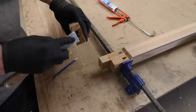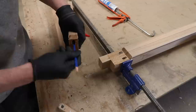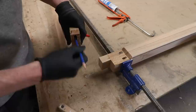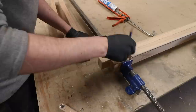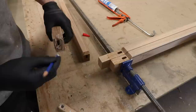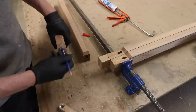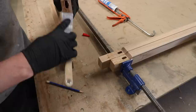There is a point at which it's drying where it's still just sticky. It's pretty much set, so it holds a bead, but it's just got a bit of stickiness to it. If you start paring the excess off at that point, it makes a bit of a mess of your chisels, but it seems to be dead easy to clean up, and you don't really get any residue spreading, because it's just set enough to stop it making a mark on the rest of your timber, but it's not hard enough to prevent you physically removing it easily. So it's a bit of a sweet spot, and they're all a different timing, so just keep trying it until you get to it. I'll try and capture it on film when I'm removing it, but that's definitely helped, and just knowing where to apply it, and not get too much.